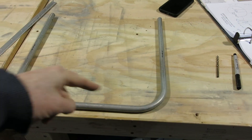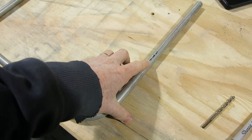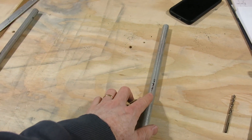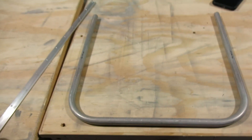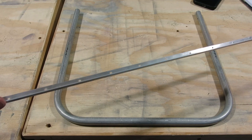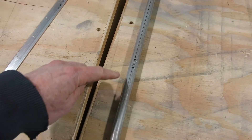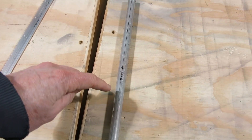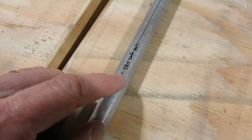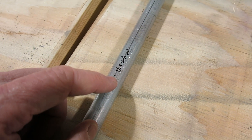On the seat bottom frame here, you have to mark a spot for a hole, and it only goes through one side of the frame, and it needs to be on center line. I just took a piece of this scrap stringer that we had on hand and lay it across and rub it back and forth, and it rubs a line onto the center line of that tube. We've got that marked, and then I measured up eight and a quarter inches for where the hole is going to go, and then I put a note — 'this side only' — so we don't drill that all the way through.